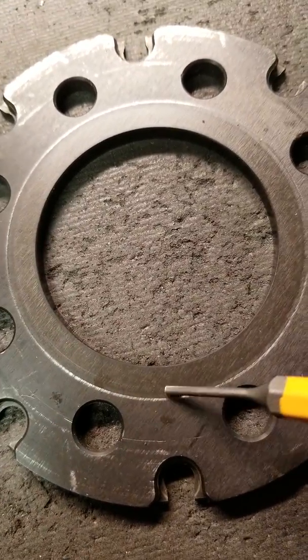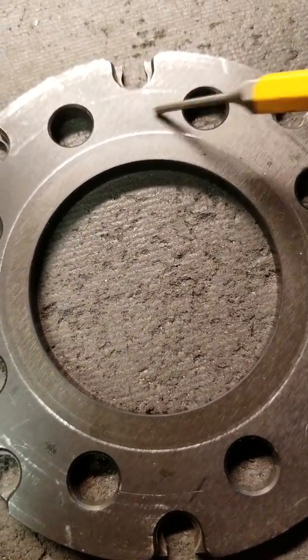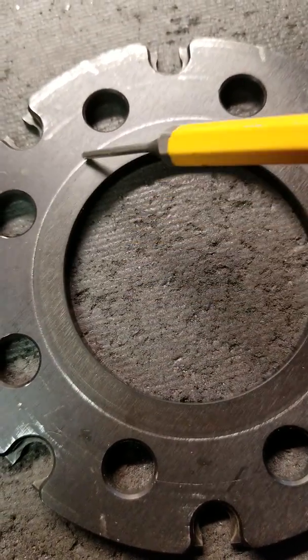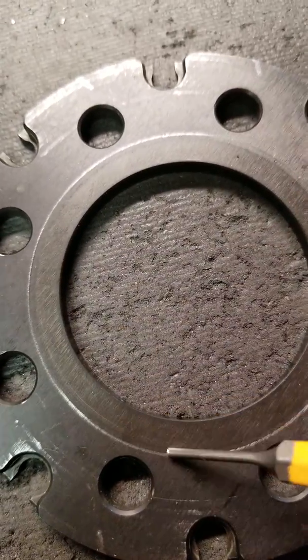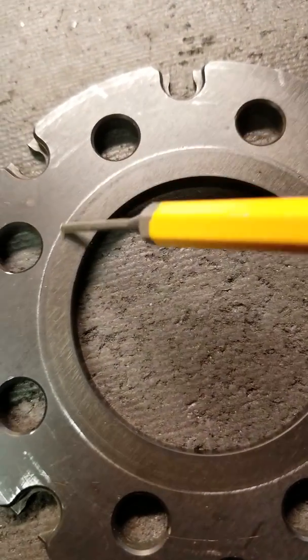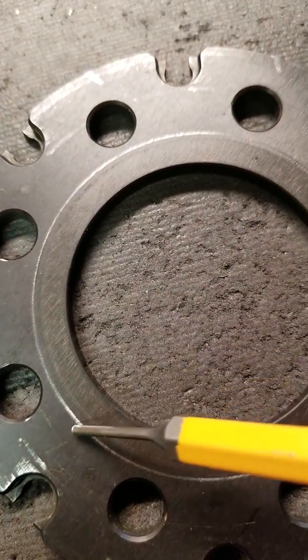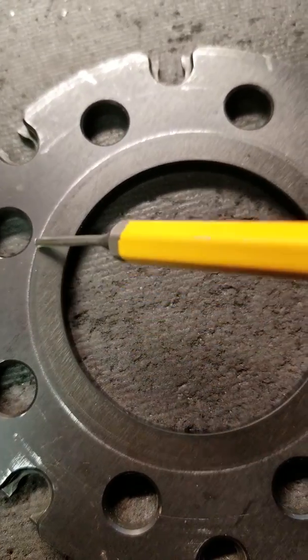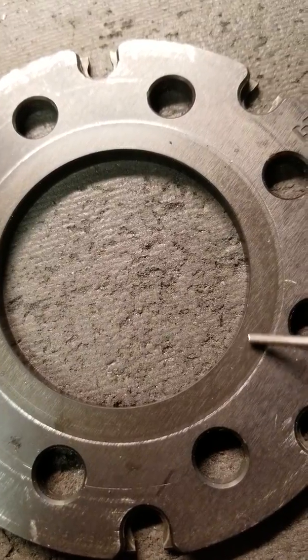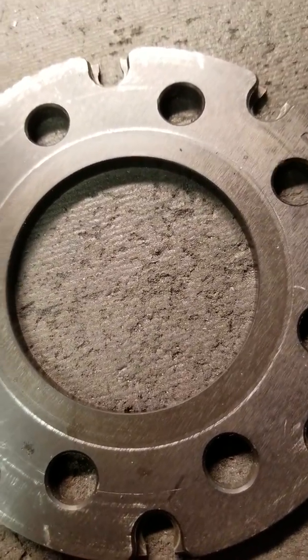Also this bright ring right here, all the way around the outside, which is unusual wear. That's caused by some problem with the retaining nut or some very poor version of a bearing sitting under the retaining nut, dragging and scraping through. As you can see, there's almost no wear on the surface where you'd normally see it — it's all right in this ring.